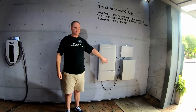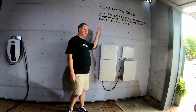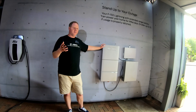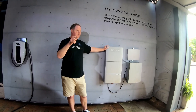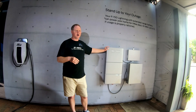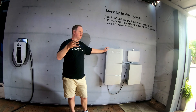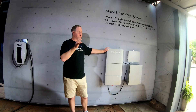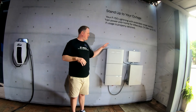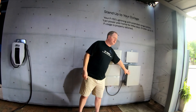The two main components are your inverter — this is your laptop plug. It takes the DC power and converts it into AC to put it into the house. This will run at 9.6 kilowatts, which is quite a bit of power. Depending on what appliances you have in your house is really the thing you have to start to consider. My house is all gas appliances, so my whole house is going to run no problem. If you're loaded up with electrical appliances — your stove, your heaters, whatever — you might have to start making some trade-offs. But it will run all of your outlets, all of your light switches, all of your fans, your ceiling lights, all of that.